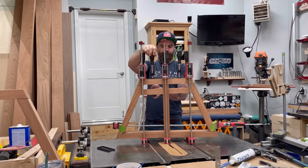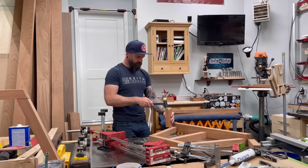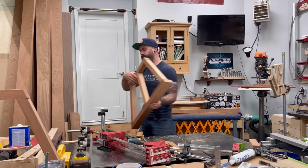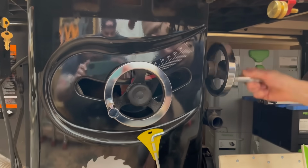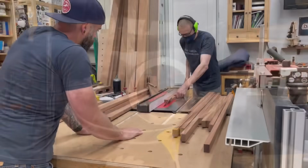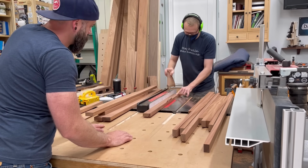By the next morning, our epoxy was dry, so I started stripping the clamps and popping off our cauls. I just glued the cauls on with a little CA glue sandwiched between some green tape, because Keith loves his green tape. And with our lower frames done, it was time to start working on the frames for our back supports. These were a little bit trickier.